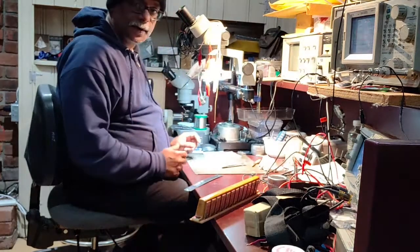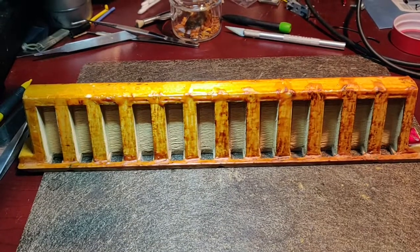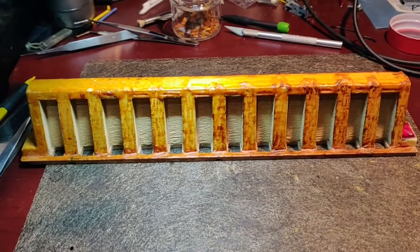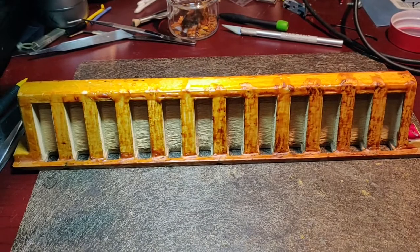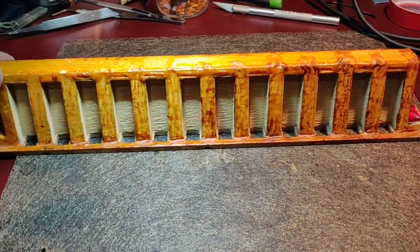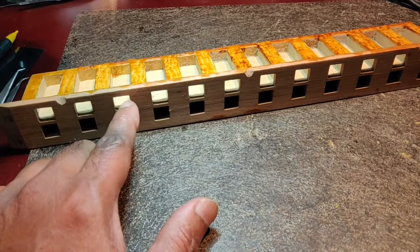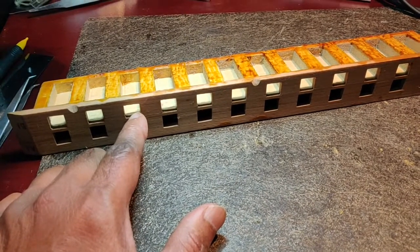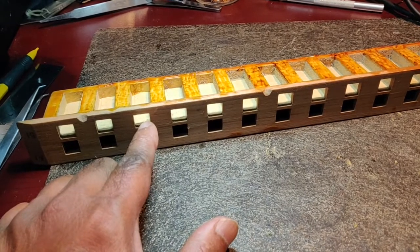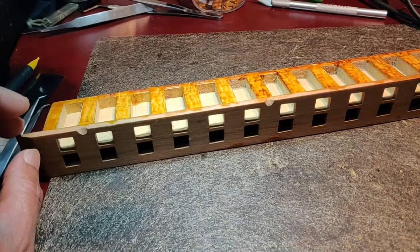As I progress I'll keep taking videos. I decided to remove all the reed plates after all, because I tried resticking one leather valve with the plate still present — it was very difficult. Even just cleaning the inside surface after valve removal was hard. I initially thought of using acetone, but instead used thinner — the less dangerous of the two. I did not want to use alcohol because of its water content; any water residue on the reeds will eventually cause rust.